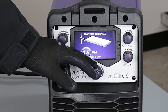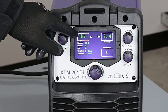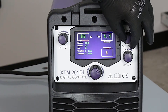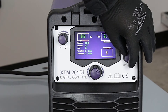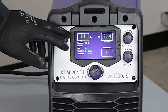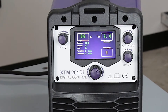I can scroll up to seven millimeters, so let's select two millimeters. We're now into the welding screen with the parameters we've selected shown down the left-hand side. The machine has pre-selected a welding amperage, and I've got the option to manually adjust the downslope time and post-gas for end-of-weld protection. There's a green zone showing the recommended working amperage — if I go outside that, the color changes indicating it's not a recommended parameter for two millimeter material. Winding back brings it into the green zone.